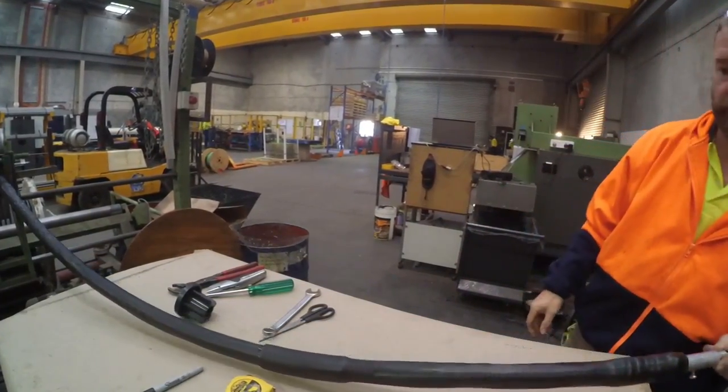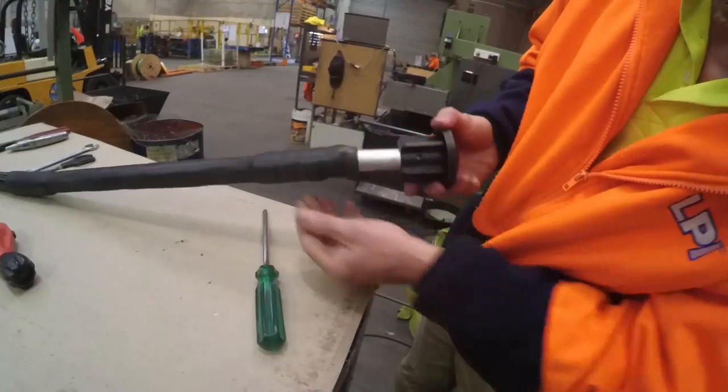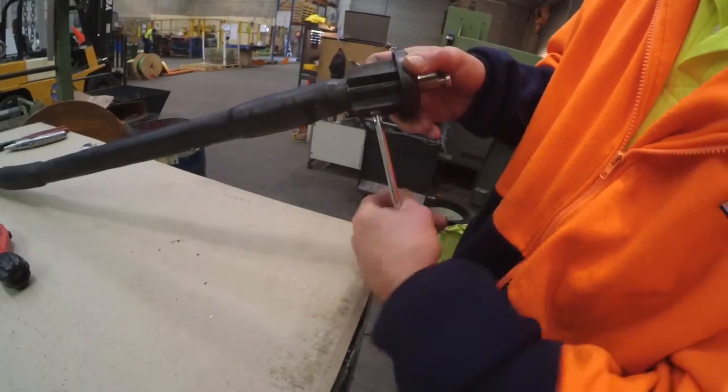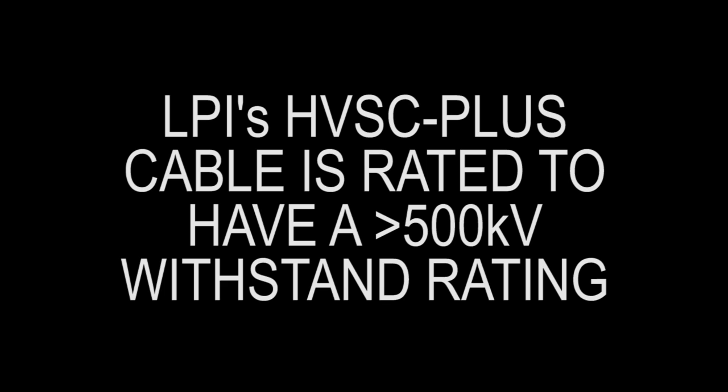Place the plastic mast butt adapter section of the mast base assembly back onto the lower finial connector and ensure that the M6 Phillips head screw is tight and secure. The lugged HVSC Plus is now ready to be connected to the base of the Stormmaster or Guardian Cat terminal. Screw the terminal onto the completed terminal base assembly and secure with the supplied M6 locking grub screw.